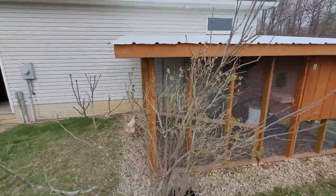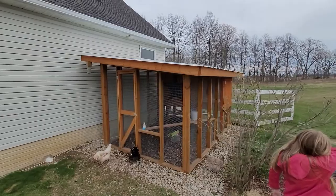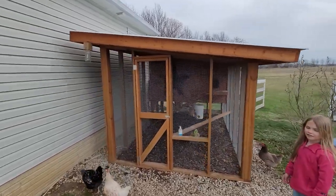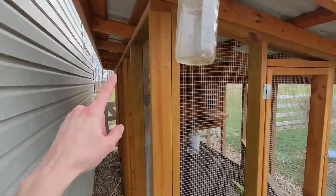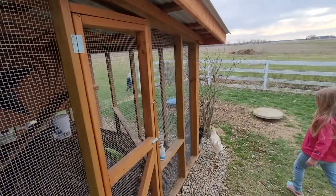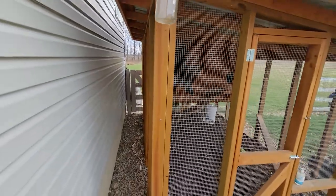I made it a single sloped roof — it's actually just a one-foot drop from left to right. I used standard 12-foot 2x4s and cut them so we have about a six-and-a-half-foot height on one side and a five-and-a-half-foot height on the other, which means you basically don't have any scrap lumber when you're done.